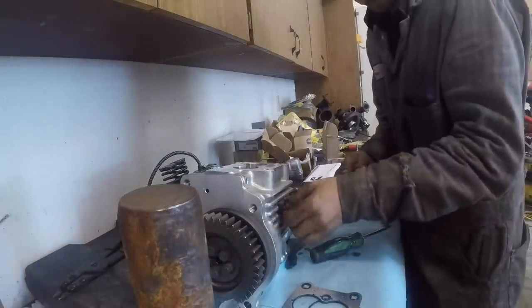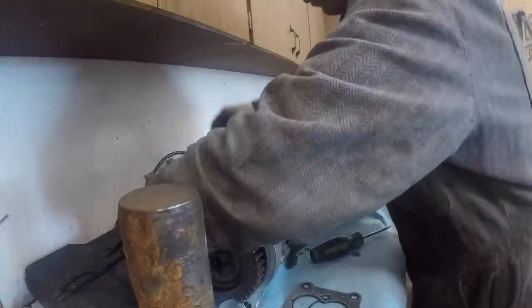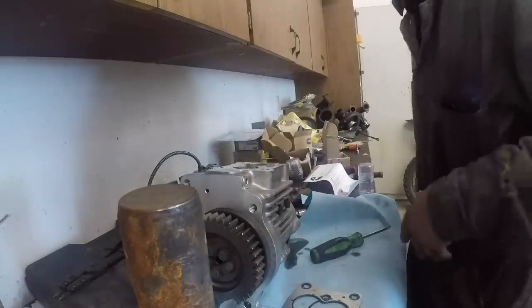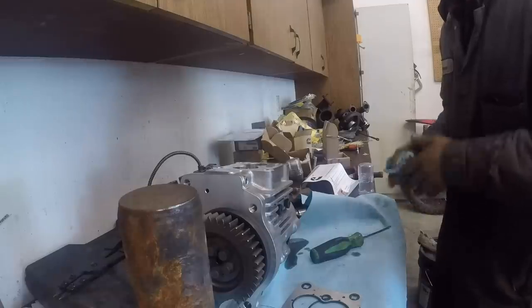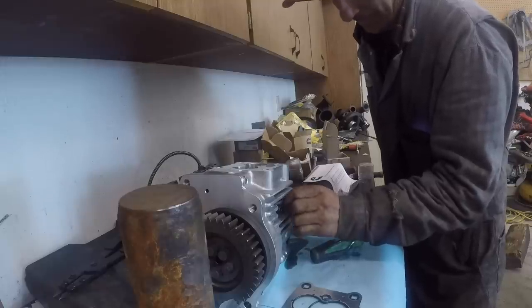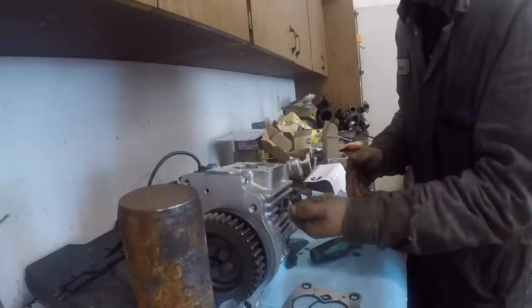And then we'll get these off. We can pop our springs off, our plungers there, and we'll take these out and put the new ones in there and clean that head up and put it on. I'll have to go get my laptop and get Cummins Quick Serve fired up, make sure we're doing all this stuff right. First one for me.